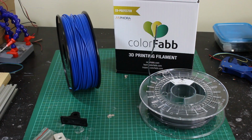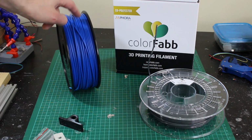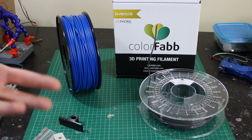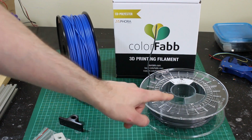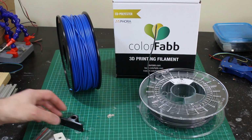So as you know, most of the parts I print are in standard ABS. This is 3mm blue ABS. There still probably will be some of this in there because it's quite stiff. But I've been looking at ColorFabb HT, which is an amphora-based material which has no VOCs in. It's actually very, very good. It's very high impact. The layer bonding's really good, and there's no toxic chemicals that come out when you melt it, essentially. So I've been doing some little tests.